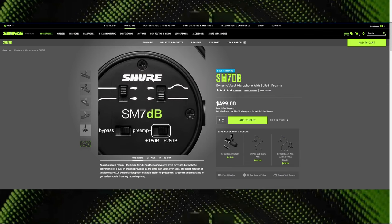I did mess up a little bit. The SM7B, and the SM7DB for that matter, have frequency response switches built into the microphone. I had the low-cut or bass roll-off filter engaged, rolling off low frequencies at around 300 Hz and below. I typically do that with the SM7B for my voice because I've gotten comments about how bassy my videos are — and that's a quality you'll get from both of these microphones: a very robust low-end response. I've now switched the SM7B into its completely flat profile. There's also a presence boost switch on the SM7B. The Ethos has no physical switches, so any boosts or cuts to the frequency response have to be done in your interface or in post-production.